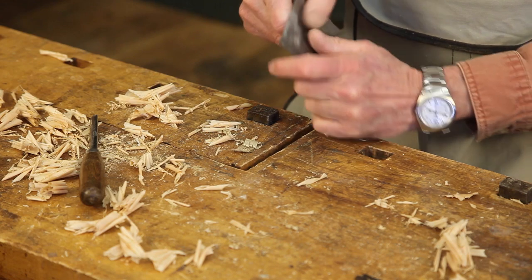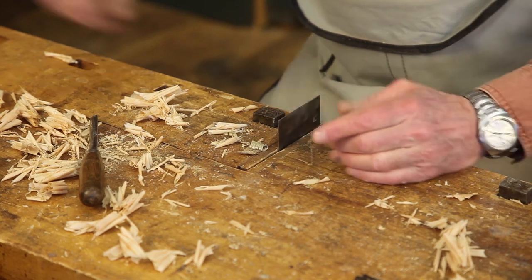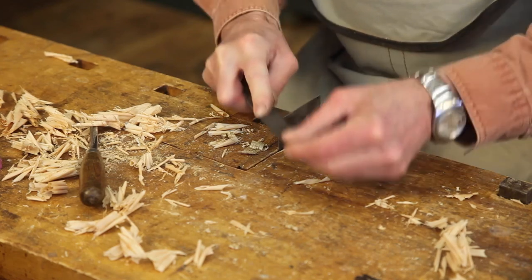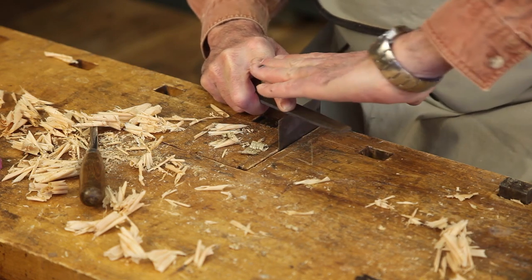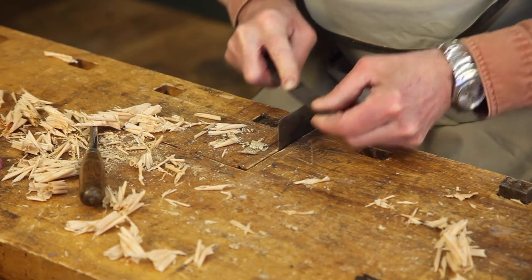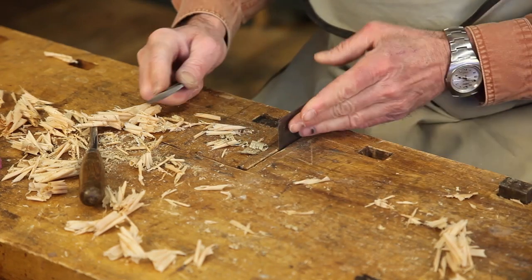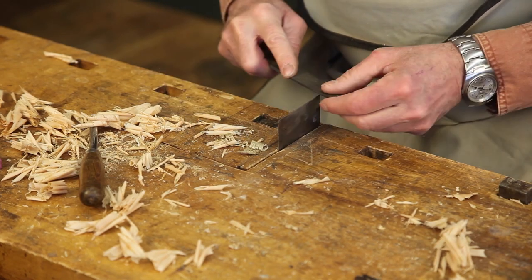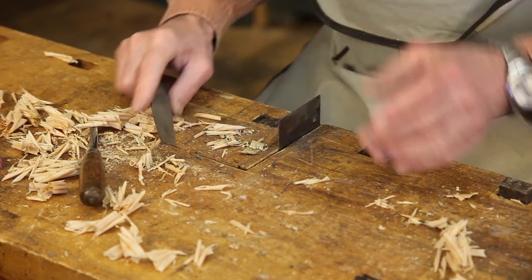This is the front of the blade, that's the back. We're just going to put it in our bench vise and take a second-cut mill file and plane right across that scraper at a slight angle — you can see that right there in front of the camera. The idea is to file this until we have a sharp edge and a flat bevel. Take a little bit more off the edges than off the center; that way a corner is less likely to dig in.